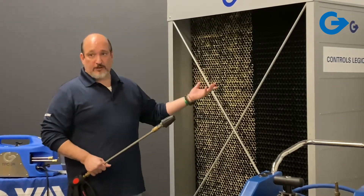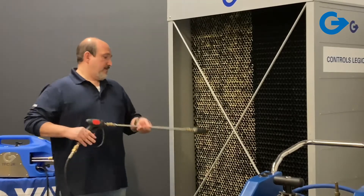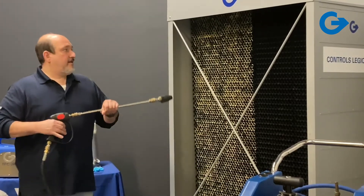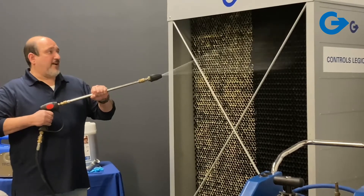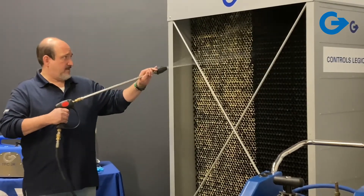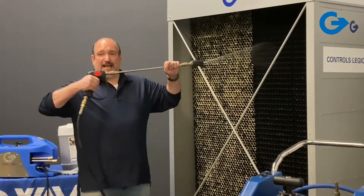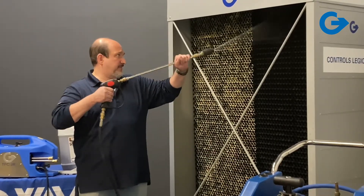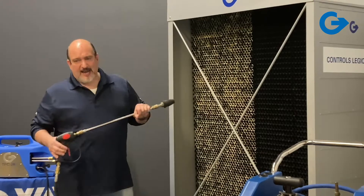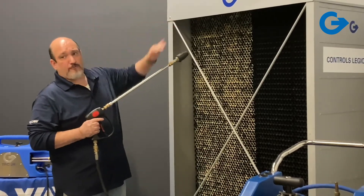Here's the rinsing pump on the floor. This rinsing pump scales down to 300 PSI at 3 GPM, and that's what you use after you've applied the gel for an hour and you're ready to rinse. It also comes with a turbo nozzle — a nozzle that gives you the power of a pinpoint pressure washer nozzle, but it spins at 3,000 RPM on a ceramic head inside, giving you a much wider breadth of cleaning with that same power. I'm going to fire it up so you can get an idea of what it looks like when you're cleaning fill and see that it's safe for the fill. You can see the large circular pattern covering a large area at a time — this is actual cooling tower fill. You can see how you get right on it without damage.